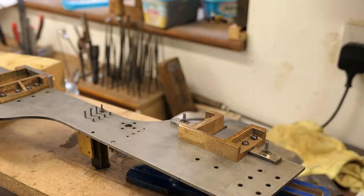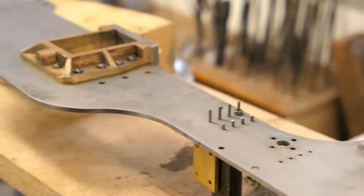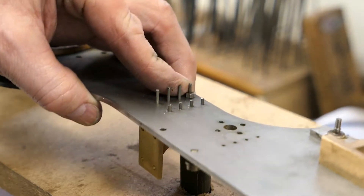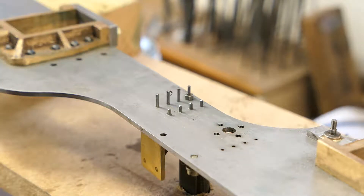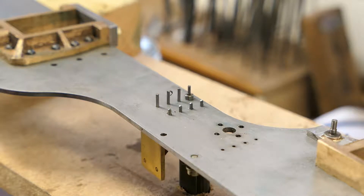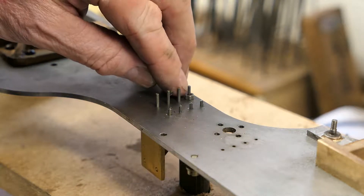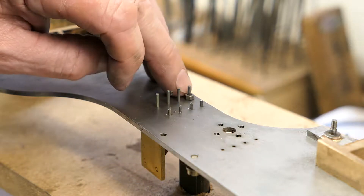So what are we going to do today? Well, I am going to rivet this bracket onto the frame of my loco. Now the first thing you've got to do when you are riveting is to get the rivet to be the correct length, and it's roughly 1.3 to 1.5 times the diameter of the rivet. These are 1/16th rivets, i.e. 63 thou, so I want something which is about 90 thou or so. And it just so happens that a little BA nut here is the correct length.